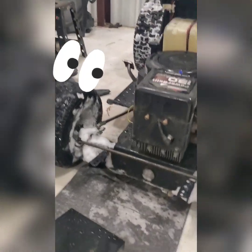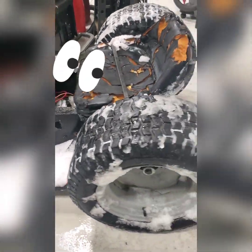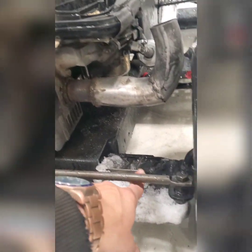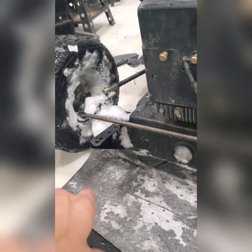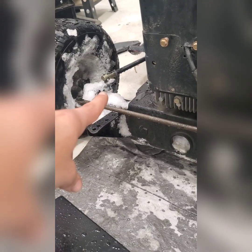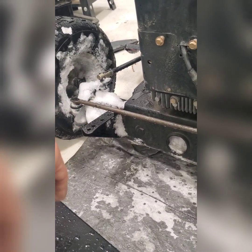In the meantime, a quick walkthrough of the mower. It doesn't have the lid on it right now — it's covering snow from the wet year. Fun things we did: we flipped the whole front-end support upside down, welded it across the bottom, and then had to move the steering tension connector from the bottom of the tire to the top in order to keep it aligned.